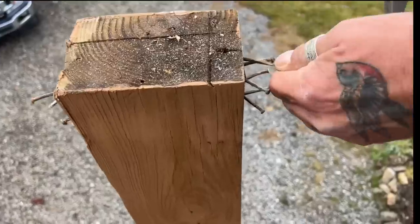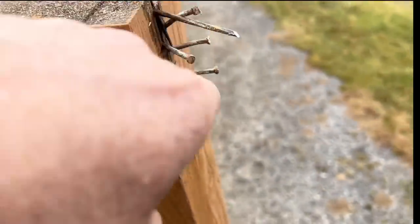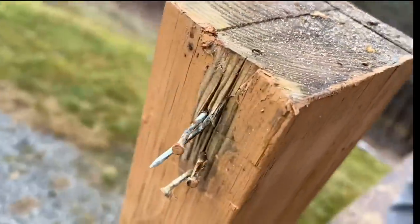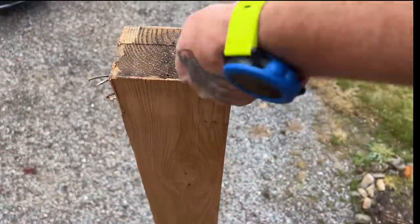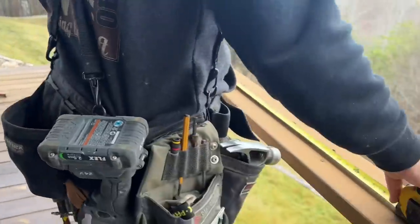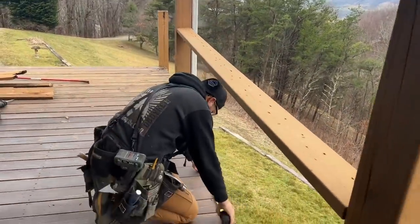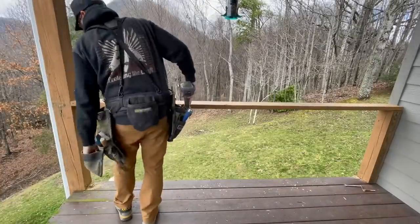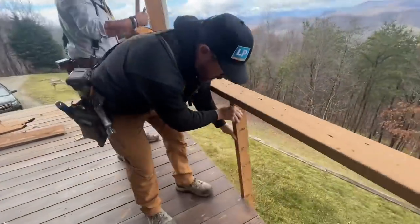These guys weren't messing around. They put like six or seven nails in the end of each one of these things. And now we can't get them off — we have to just saws-all straight down. We've got all the pickets and the old top caps taken out. Now we're going to reinstall just a single two-by-six top cap with an intermediate post to cut these sections down from like a nine-foot span to like a five-foot max for these cables. And that'll just help — if someone would try to spread the cables on a shorter span like five feet, you can't really spread them.